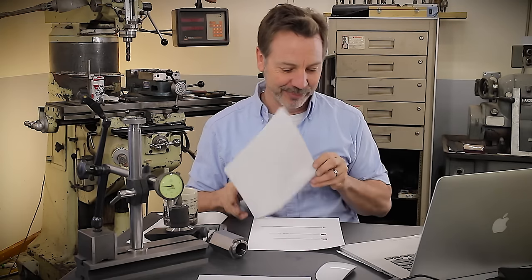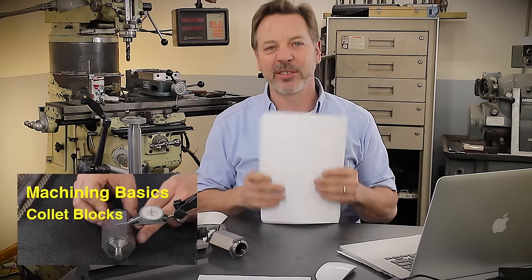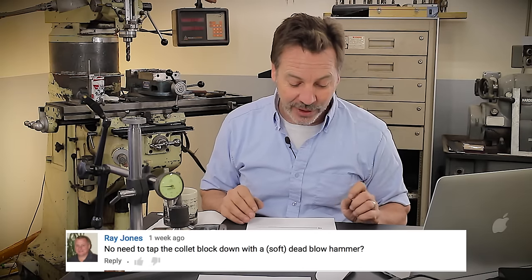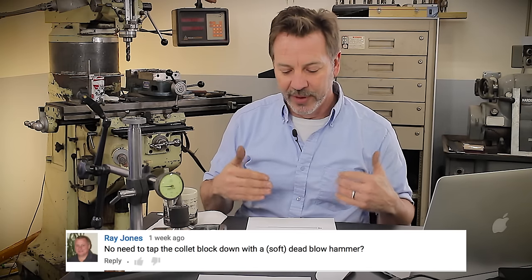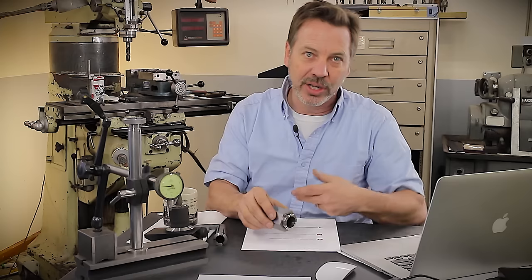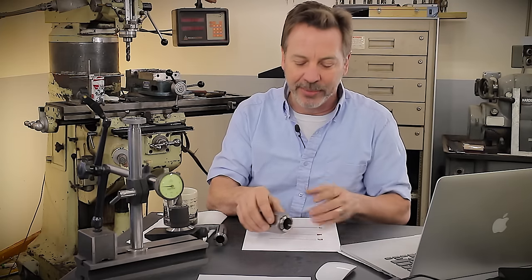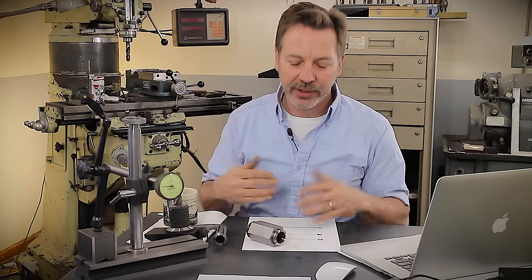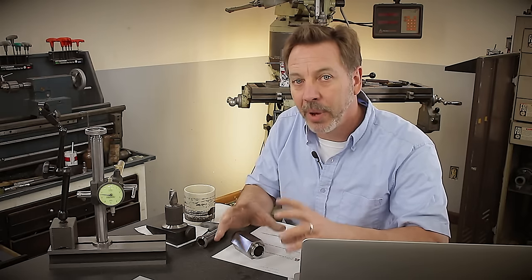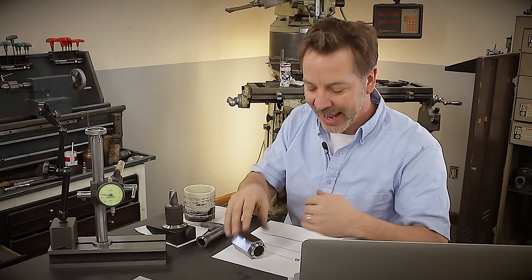Now let's get to collet blocks. I did a thing on testing your collet blocks and some ideas of how to use it. Ray Jones asked a great, simple question: 'No need to tap the collet block down with a soft dead blow hammer?' What he's talking about is when the collet block gets put into the vise and you clamp it down, is it going to move? And the answer is yes. Whether you need to knock it down with a hammer depends on what accuracy you're trying to get. For what I was doing, it was just a representation of what is possible, so I didn't bring in the hammer.